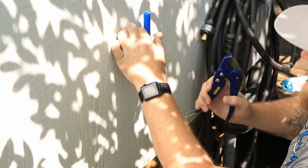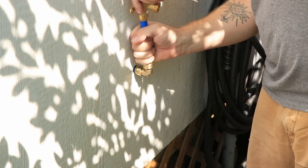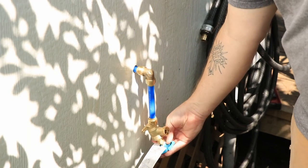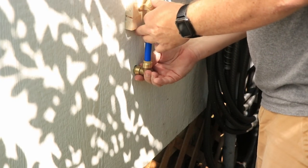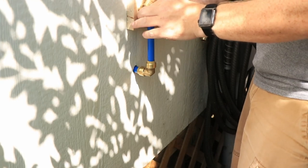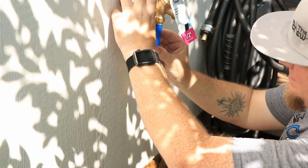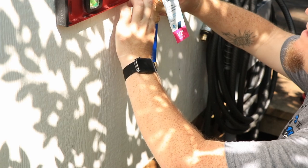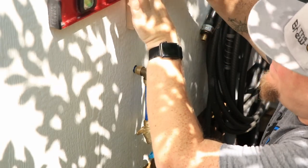Here I'm just cutting it to the right length for the faucet. What I ended up doing is I bought a SharkBite water spigot — it doesn't have a counter flow on it so I can actually run water into it, not just out of it. I was looking for a design where I could open up the valve on the spigot and water would flow inward. Now I'm putting a piece of wood behind there because I want it to stick out enough so it's even with the elbow and the faucet can fasten to it. I took a level, put some double-sided sticky tape on the back of that wood block so it would be level, then pushed down and the tape would hold it in place until I fastened it with screws.